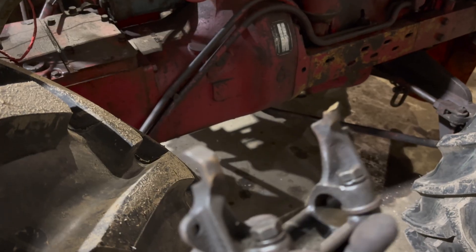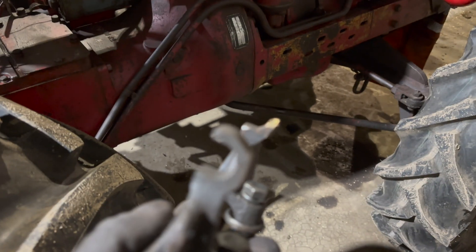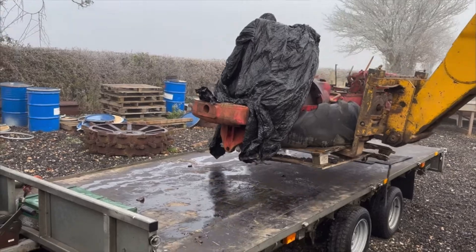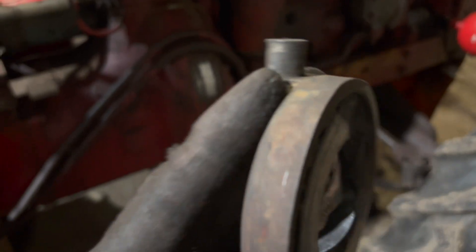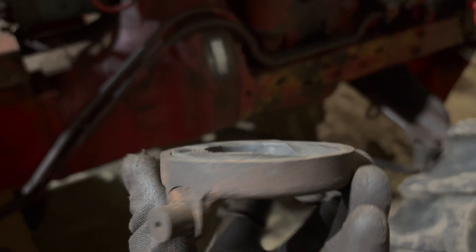While I was doing that, I discovered that the winding arm handles aren't all the same. Looking closer at the picture, we can see the clutch fork has been broken before and brazed back on, possibly in its working life. Luckily we got this other B450 for spares last year, which has a compatible clutch fork and carbon bearing which was like new compared to the one we took off — fairly worn down and looking as though it's picked up at some point, as it has a great big chip in it.